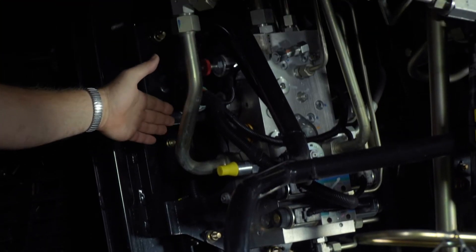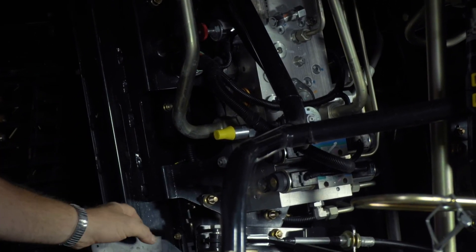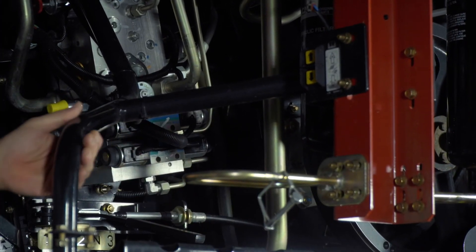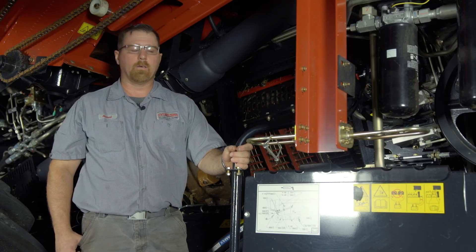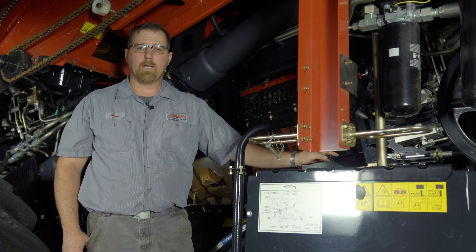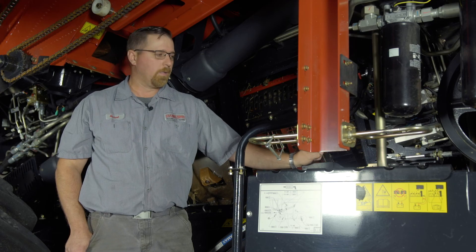Also in this area, behind the hydraulic control valve and our rotor shift lever, that is a really good area for crop material to build up during harvesting, and it could be a potential hazard — so we want to make sure that area gets cleaned out regularly, daily if we can. Also behind the chopper pulleys back here we have another area that's prone to crop buildup, and we want to make sure we get that cleaned out as well. If we can do that daily, that's great, because once the crop material gets piled up it's so much easier to get rid of and blow out while it's nice and fluffy and dry, as opposed to waiting a few days when it collects moisture and gets all packed in there.